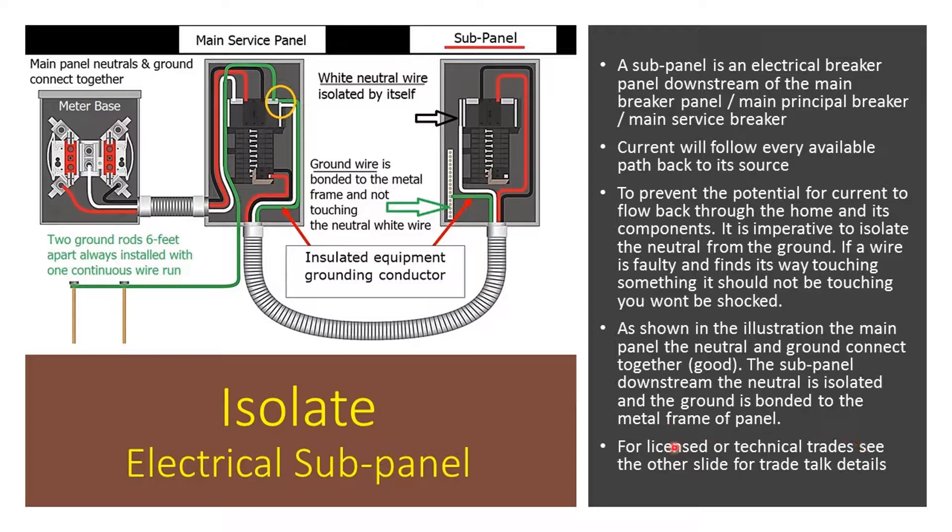I have a better demonstration for licensed electricians, but for general knowledge, let's continue on. Here we have the neutrals and the grounds bonded at the main panel. If you notice, there's a large breaker here — this is probably going to be a 100-amp breaker that's going to feed power to the subpanel. So let's say we have a main panel outside at 200 amps, and inside we have a subpanel in the laundry room or the garage at 100 amps. We're going to send 240 volts here to the main, and we're going to put the neutral here. This is going to be isolated — nothing's going to touch this neutral — and then the grounds are going to be bonded to the metal frame.